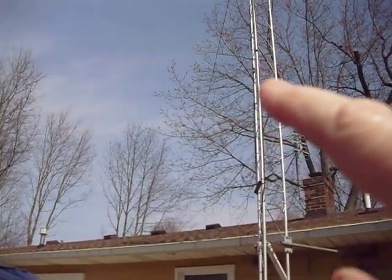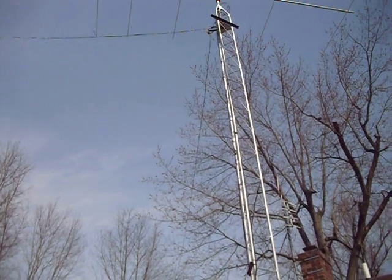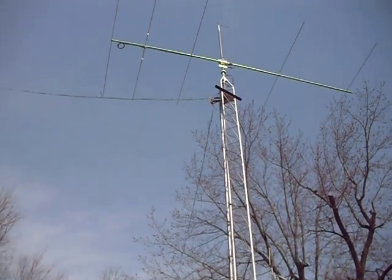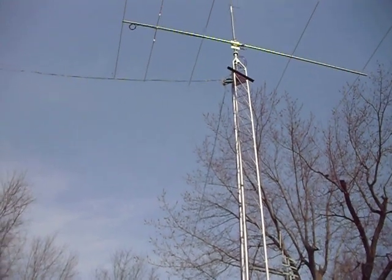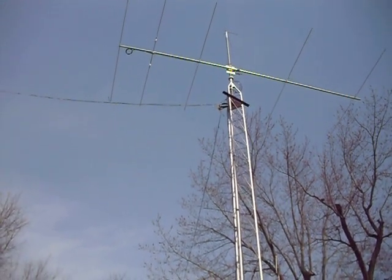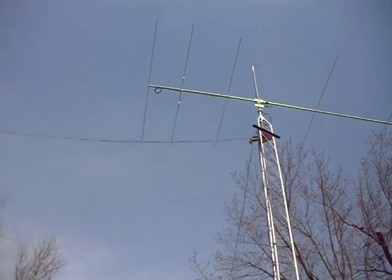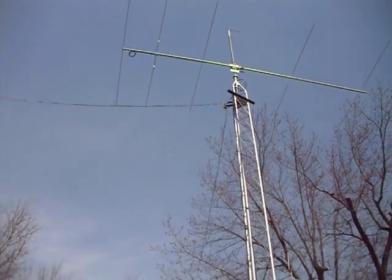Then the same wire — you can see it coming back in the branches up there — goes back to this point here again. It's 251 feet of wire, and that is a full wavelength for 80 meters. When you attach it up here, all I've got up here is a quarter-inch thick piece of Lexan plastic. It's been up there several years, but it was not on this antenna — I took the other antenna off. So this wire looks kind of crummy here, it's coming apart, but it still works great.